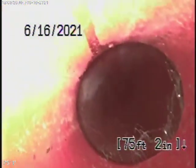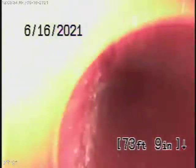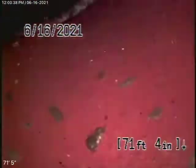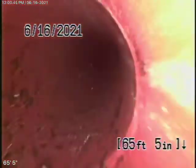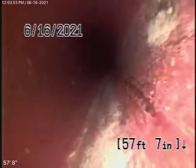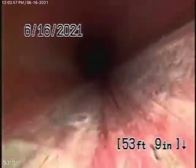You can see this is in pretty clean, nice, good condition as it comes onto the property. We've got some very minor little roots coming in here. Now remember, we're looking for big problems like major breaks, major big holes, or major shifts in the line. These little roots getting into the clay pipe — that's very common. You're going to find something like that. You can even normally find little cracks in a clay pipe. In my opinion, this is all in good condition. You can see it's nice and clean; this line is functioning very well.